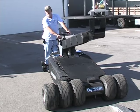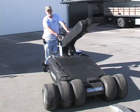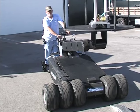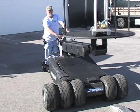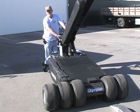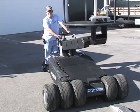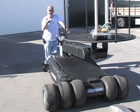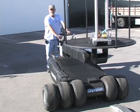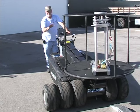That way, going down the road, it cannot boom up or go through the top of the trailer. Just run it up and down until it runs out — you usually get about three strokes out of this. Now it's just ran out. Now bring it down — bring it all the way down until it's out of travel. Some guys have been traveling with the arm partway up, and what happens is going down the road it's pounding on the hydraulic cylinder, making oil bypass it. So you always want to exhaust the hydraulic system and bring it all the way down. You'll see it land, and it can't go any further. It's fine now.